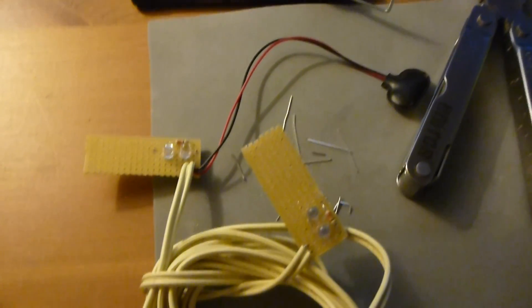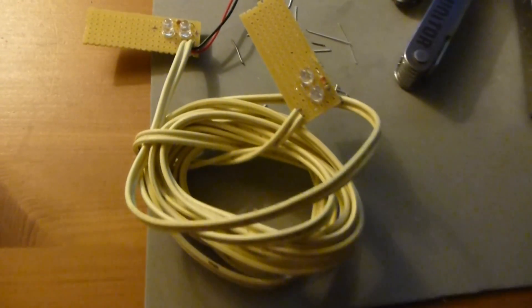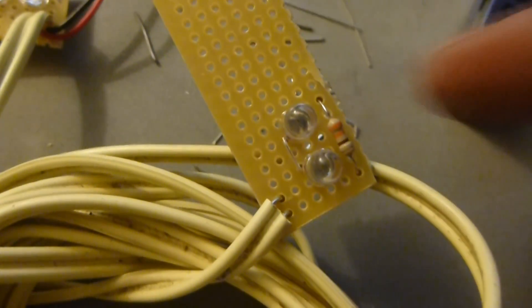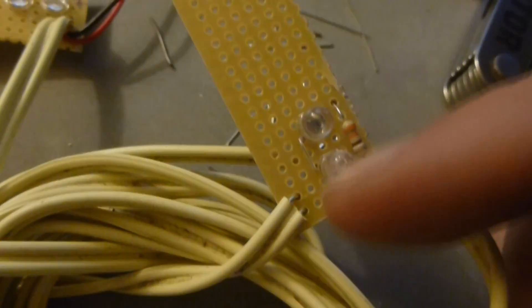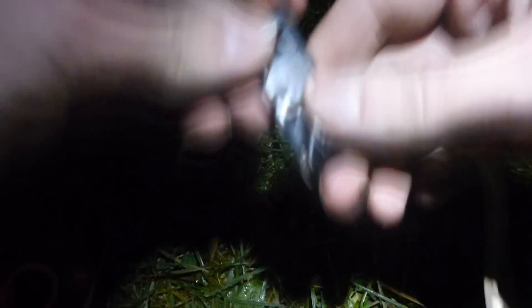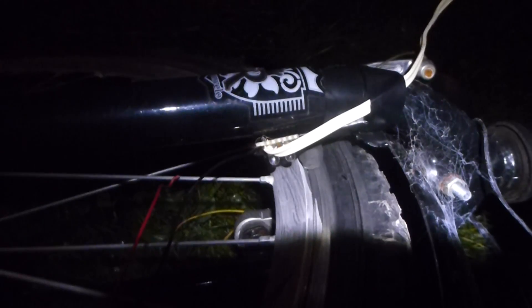Here I'm halfway through the soldering — two panels in parallel connected to each other for one power supply, with two LEDs on each. To prevent short circuit of the panels to the metal bike, I applied some electrical tape on the back side of the panels. I also used some electrical tape to hold the panels in place.